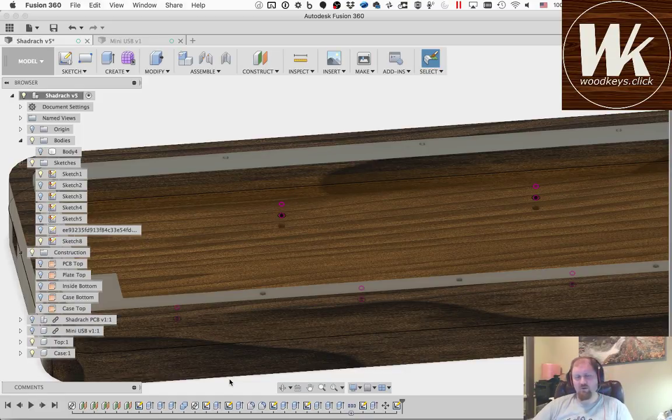When you have a hot swap PCB, you can do one of those two options, but if you do a floating PCB, when you put a new switch in, it's going to push the PCB down. And similarly, if you have a floating plate, you run the risk of pushing the plate down when you are swapping your switches, if you take too many out at once, and it makes it kind of difficult to assemble. So we want to have both the PCB and the plate secured to the case, and that kind of complicates things when we're mounting this.